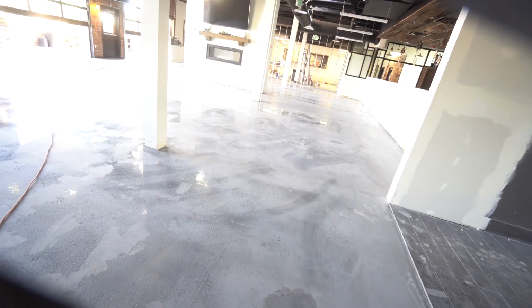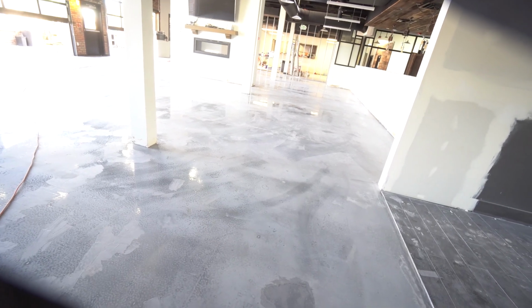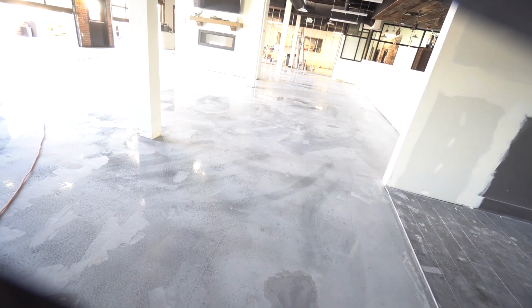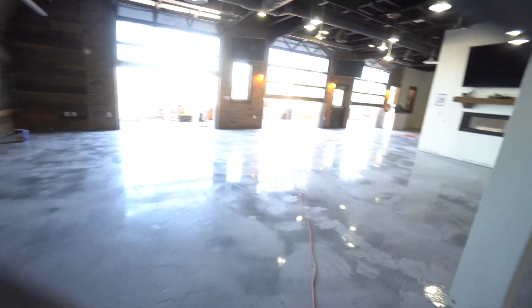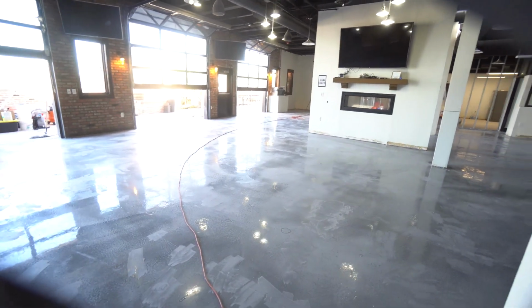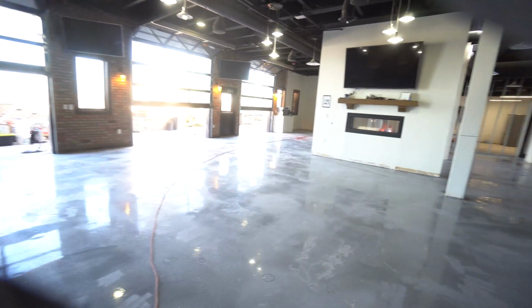So I did a basement the other day, a couple days ago, and it was snowflake, pearl, butterscotch, and suntan, and a touch of coffee. And so all four of those colors, the primaries, were all light. And so I had a white base coat. In fact, I had to do 2 coats of white base coat on it because I wasn't getting enough coverage. And then every time I would come back with the 80 grit, it would show like little spots and the little dimples that were sanded off.